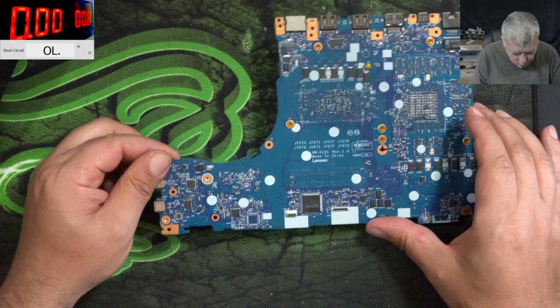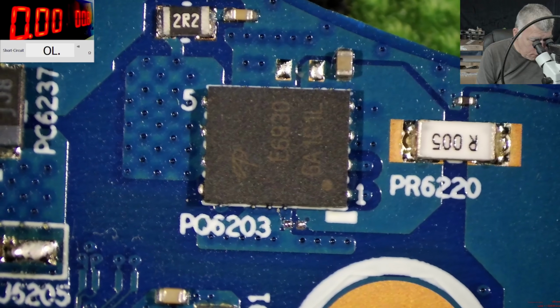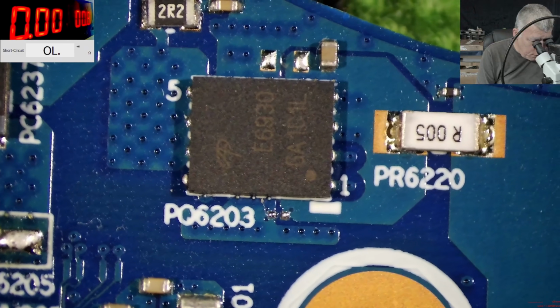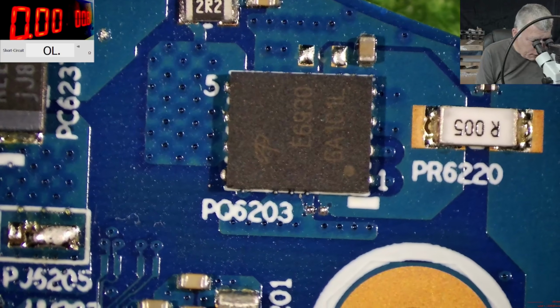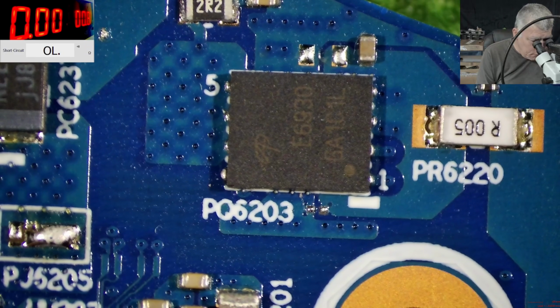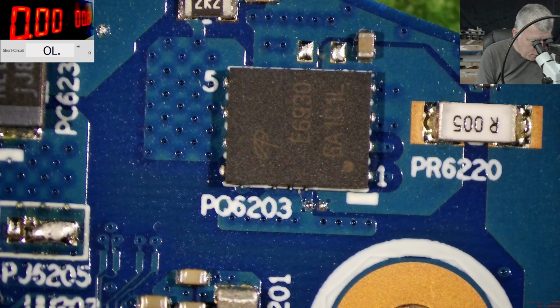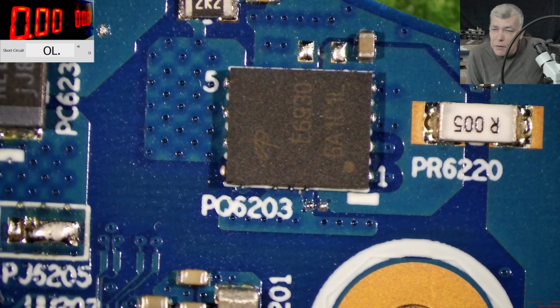Let's check under the microscope. I can't see anything wrong here. But clearly, this MOSFET is switching that coil. So do you think the MOSFET is shorted? Hmm? But how can the MOSFET be shorted, because the main power relay is not shorted.